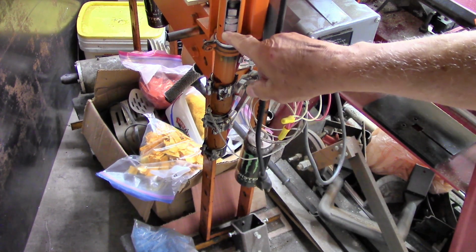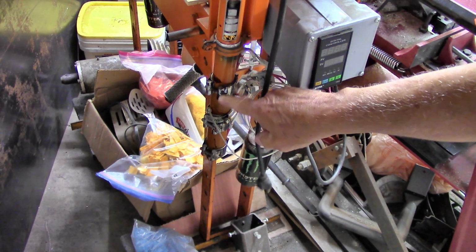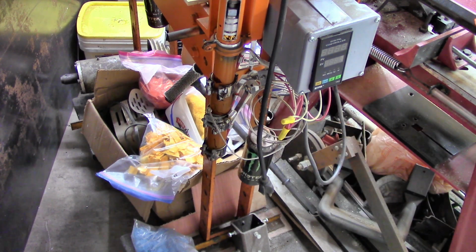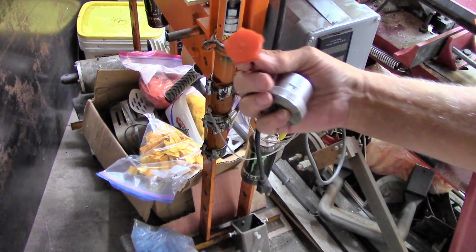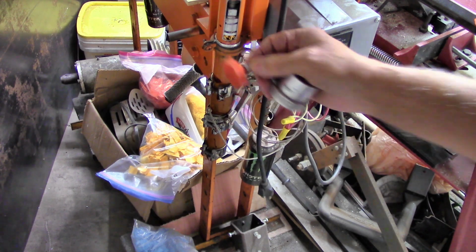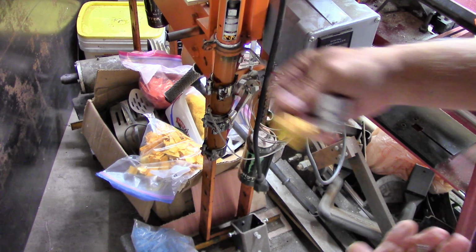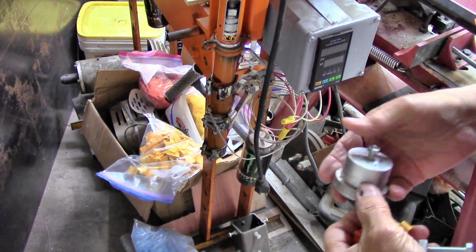This is where you put the plastic in and you shove it down. Here's 3 heating bands to melt it, and they're controlled by the little gray box there. I almost said black box, but it's not black. And here's a couple of the knobs I've made with it. I could make other things, but knobs were handy and I needed some at the time.